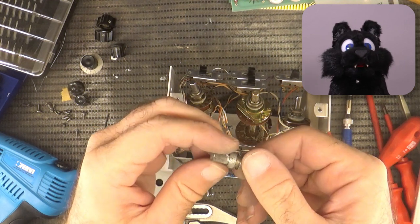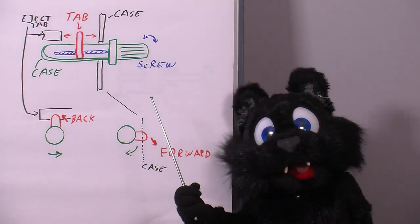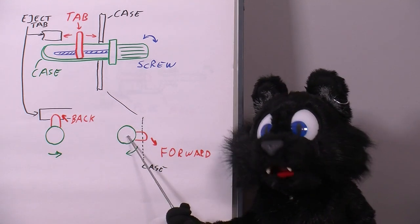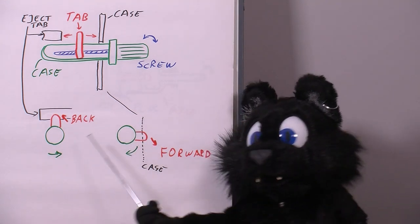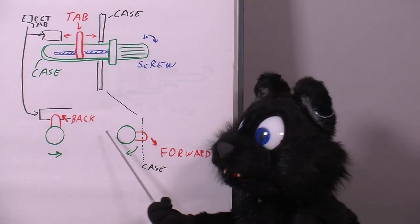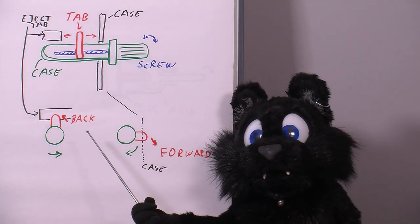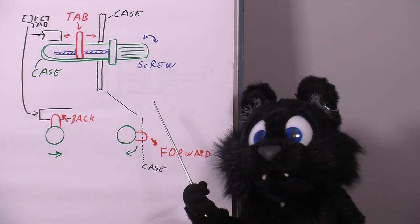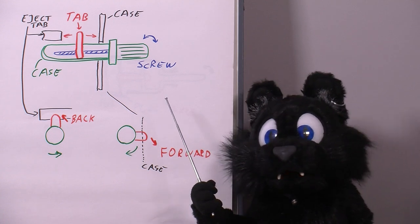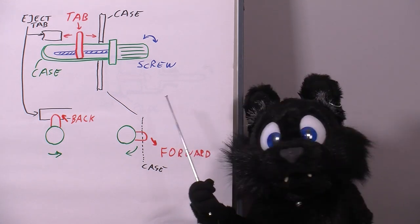The plug-in unit is held in place with a strange lock. When you turn the knob, the locking tab will move between two positions and engage either the frame for locking or another tab behind it and will push out the module during unlocking. This way you don't have to pull on the electrical knobs to overcome the 50-pin Centronics plug. Interesting design.